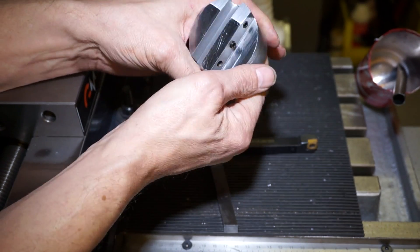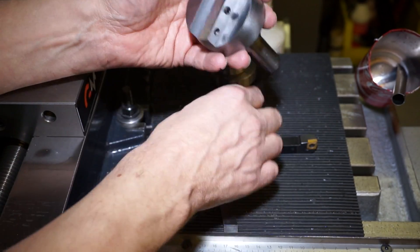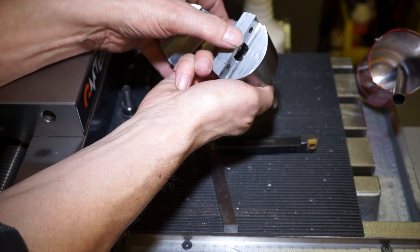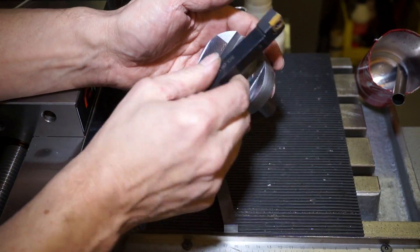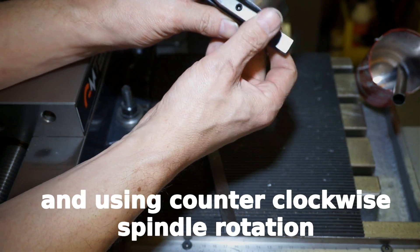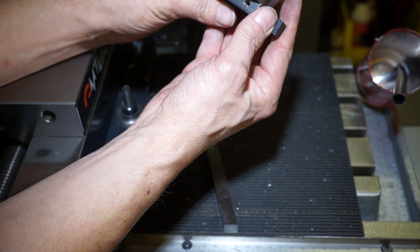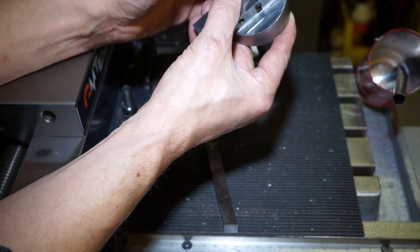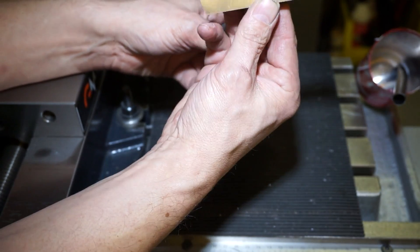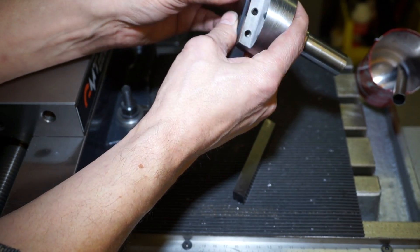For the tool holder, the slot is on the left hand side of the center line, whereas on this one you see the slot for the tool is on the right hand side of the center line, and that makes this usable with an ordinary turning tool. Of course I could buy some left hand turning tools, but I figured why not use the ones you have and buy good inserts instead. I'll also grind a high-speed steel tool bit for it, but it's quite handy to be able to use some carbide for fly cutting.